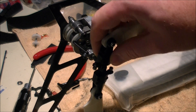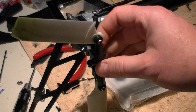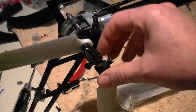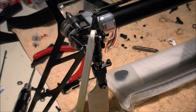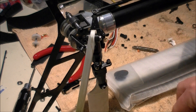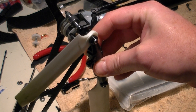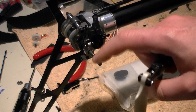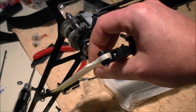The set screw gets a little loose. The problem is that the way the set screw sits on the shaft, being a set screw, it burrows into whatever it's pressing up against. After some time, where it burrows into the softer metal, it will press into that as it's supposed to, but being a softer metal on this shaft, it can develop a little bit of play over time, so it's not actually pressing as hard as it was at one point.